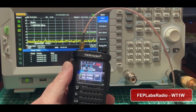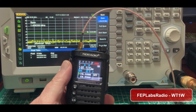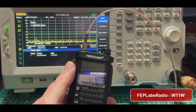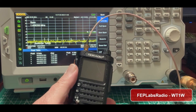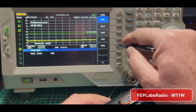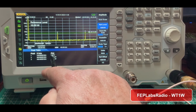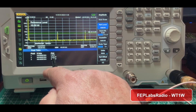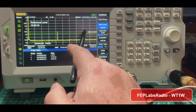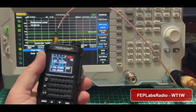This radio is a fail. At low power it seems to be fine — it does not fail the FCC regulations. Even at medium power it's good. Low power is about one watt, medium power is about two watts, and high power is right around seven watts give or take. Switching our units from dBm to watts: 7.3 watts for our fundamental, 18.7 microwatts for our second harmonic, and 41 microwatts for our third harmonic — which is again above minus 16 dBm or 25 microwatts. So unfortunately, this radio is a fail.